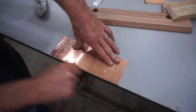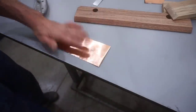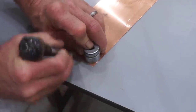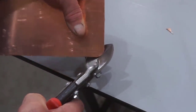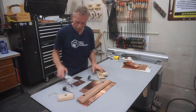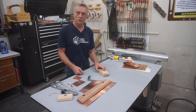One edge of my strips is a little bit ragged so I'll burnish it down with the shank of a scratch awl, then use a socket to scribe an arc on the corners that I'll trim off with a smaller pair of snips. I'm using a 22-millimeter socket for those corners. I'll run a file along these edges once I get things put together to clean up the burrs and prevent lacerations. There's something about how a unique set of tools used in unusual ways can produce pretty cool results.